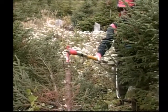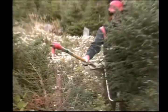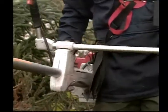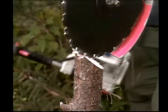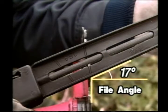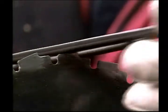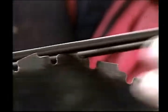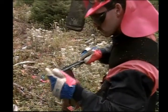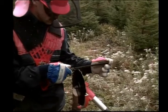With the blade in a vertical cutting position and holding the tube, make a downwards cut into the stump deep enough to hold the blade firmly. Wear gloves and use both hands. File the sawtooth at an angle of approximately 17 degrees. Only file in a forward motion on every second tooth. This procedure is then repeated for the other side of the blade. Blades should be sharpened at every second gas fill-up, more often if the blade comes in contact with rocks.